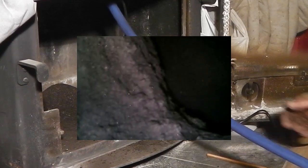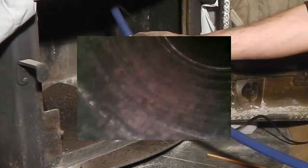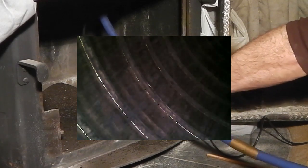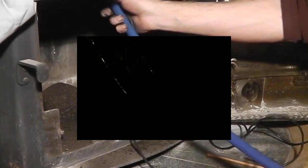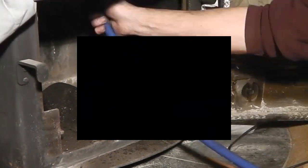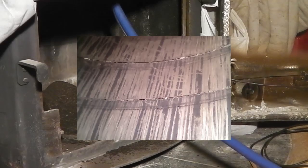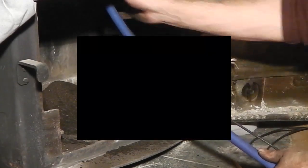That's right at the top of the stainless steel flue. You can see nice shiny metal. That's the soot that we've got down from the initial sweep and it is just soot. Some of it has gone a little flaky but that's soft. There's no creosote or anything like that built up in it.